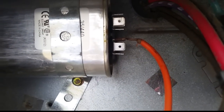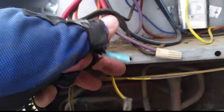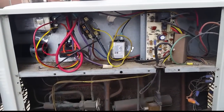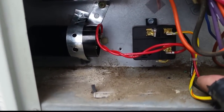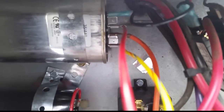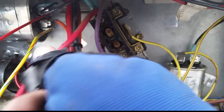That's our start winding wire running to the capacitor from the compressor, with the jumper across the run wire to the contactor. I had to do the same thing with the run wire from the fan motor - this is the start wire for the fan motor, which goes on the other side of the capacitor. We have our 521 hard start hooked up: black wire to the contactor on the common side, red wire to the single run capacitor on the run side, and the yellow wire from the 521 over to the orange start wire on the compressor capacitor, with jumpers over to the contactor on the run side. You can see the run wire for the compressor is here.